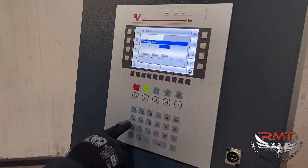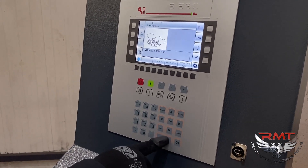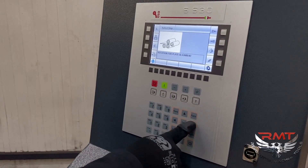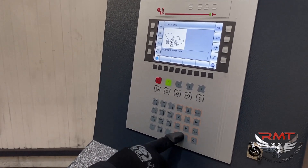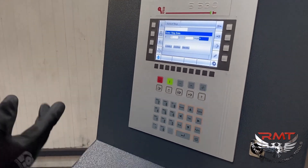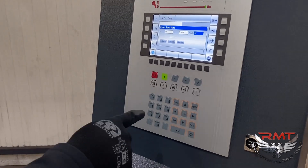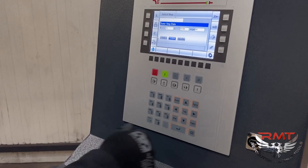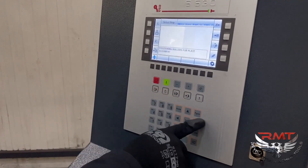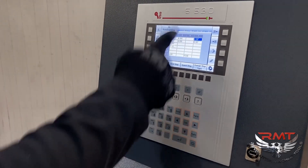I'll set a 14 inch radius for today's bending. Then 'Change Step Type' for step six — forward rotation. For 14 inch radius, the angle for this small radius I'll accept as 45 degrees, and the machine calculates the arc length of the pre-bending. Step seven: change step type, 'Entrance roller down' — let it calculate the position again.